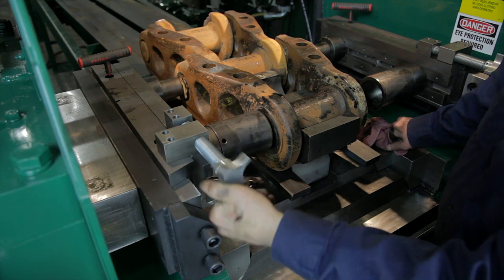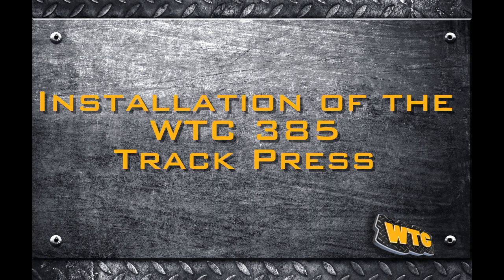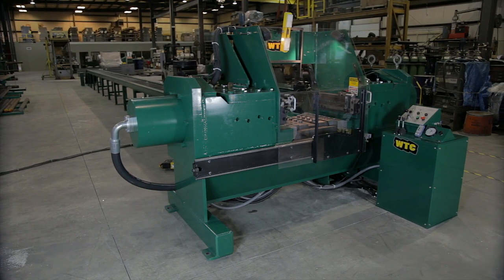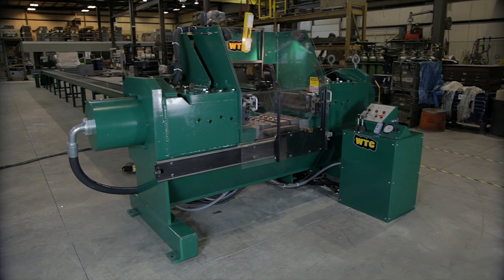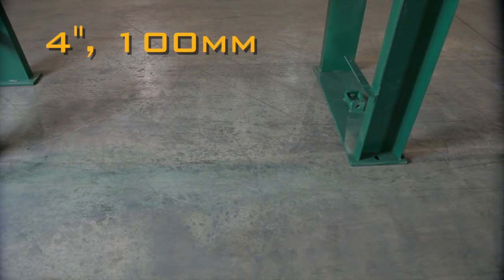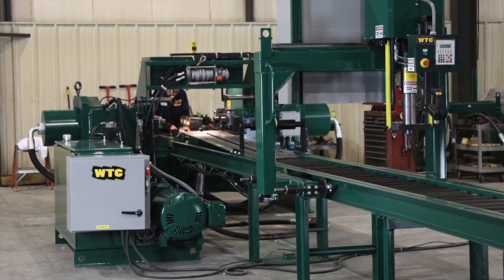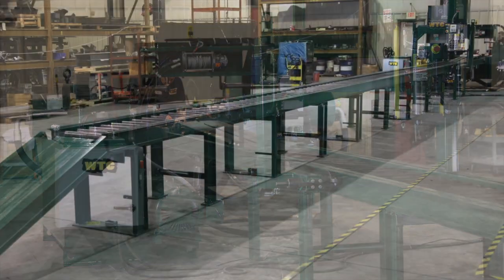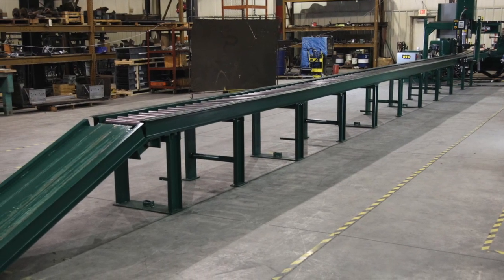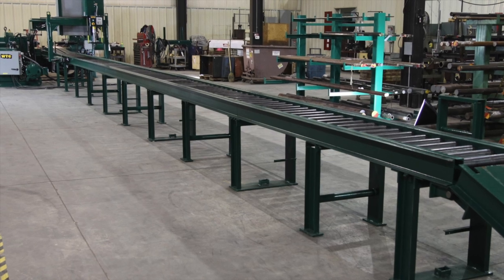Contact WTC Machinery for tool catalogs and for help selecting and using the tools. This section of the video manual covers the installation of the WTC 385 Track Press. Use care in locating your new track press. The recommended site is well lit and protected from the elements, with a 6-inch minimum reinforced concrete floor under the track press, and a 4-inch minimum reinforced concrete floor under the index table and conveyor system.